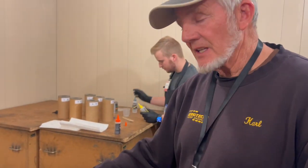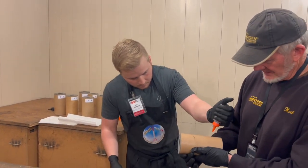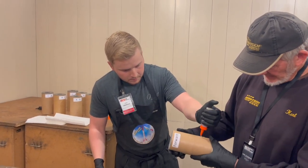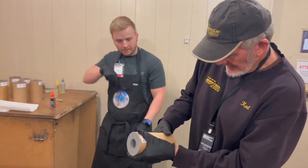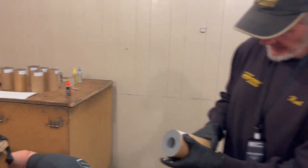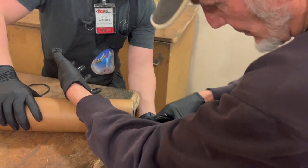I typically load from the nozzle in. I put the end that I plan to use for my seal disc forward already. You can do this by yourself, but it's pretty intense that way — it's easier if you have an assistant. We're not really slopping a lot of glue on here, watch for the dripping. Essentially you're going to start putting the grains in, and I like to put them in with a twisting motion.